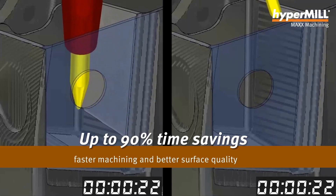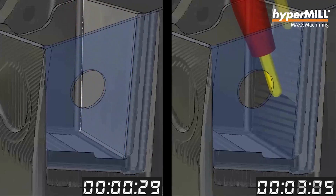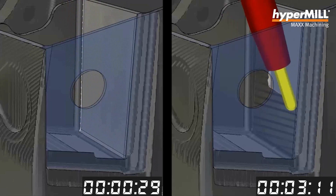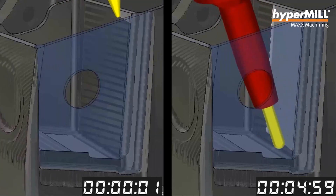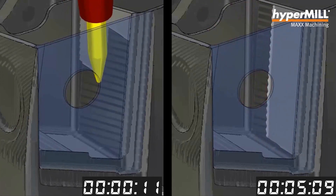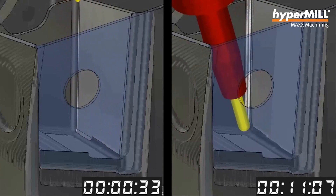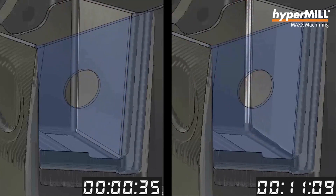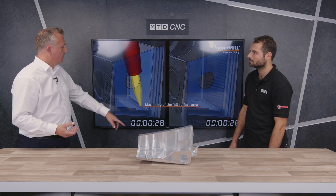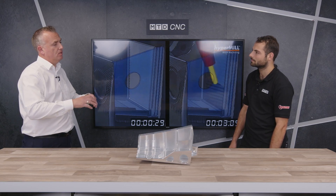That shorter, more rigid tool lets you get really inside deep pockets using much larger step-downs, and the end result is it machines faster. You can see from the video behind me and from the surface finish here, there's a very specific cycle you can run. This is a planar face — you can see on the video with the ball mill running a lot slower due to the smaller step-down. Whereas we have a cycle called tangent plane machining, where you do a five-axis swipe across the face, tilting into the corners, and then a blending pass to make sure the surface is completely finished.